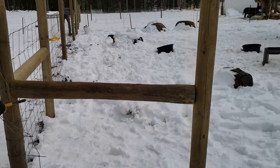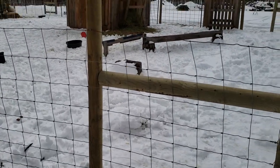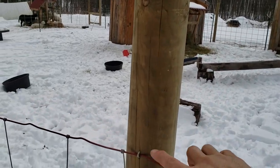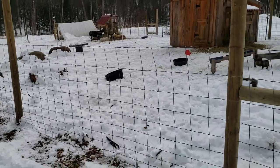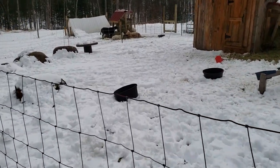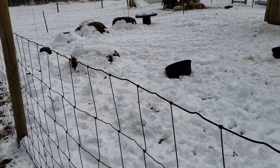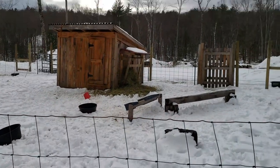We've got these corners set up like I showed in the previous video — these are eight-foot pressure treated posts. We sank them all two feet in the ground. We've got a little extra height up here and we'll be able to run an electric wire across the top. I went 16-foot spacing between these thinking I'd save some money on posts, and I thought it would be good enough with the woven wire. It is pretty tight, but if the animals were pulling or putting their feet up on it, it might start to bend. So I'm going to end up putting T-posts in — you can see the ground's a little unlevel here and the fence isn't quite touching the ground. With this added flexibility, we'll use a T-post with T-post clips and get that driven in there — it really tightened it up on the other side.